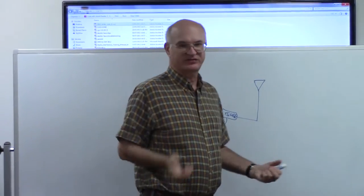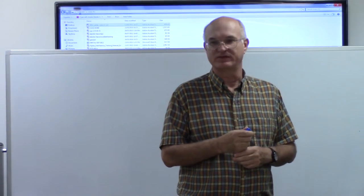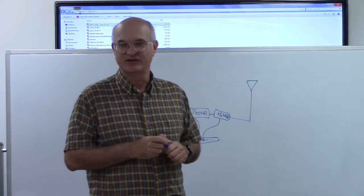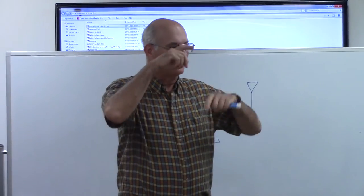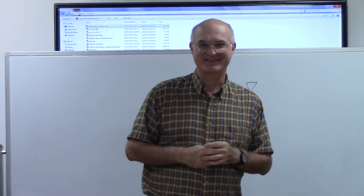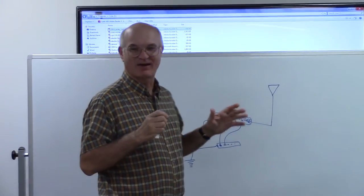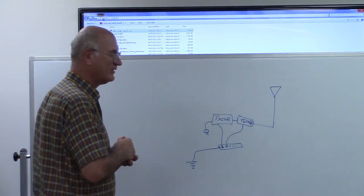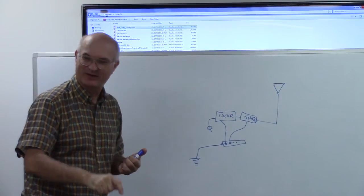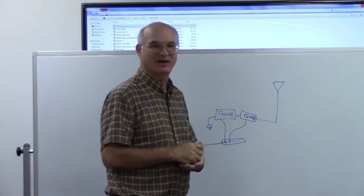So parts of buildings clipping to the cold water pipe will probably cause you more grief than relief, because essentially you'll have this big antenna going through everybody's apartment. What that means is big RFI problems, like running an antenna next to your neighbor's TV down the wall. So in apartment buildings, this kind of ground is usually not possible.